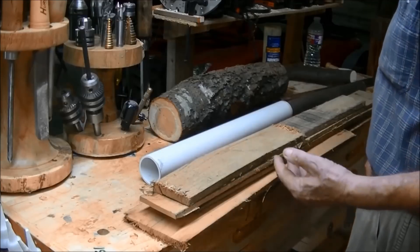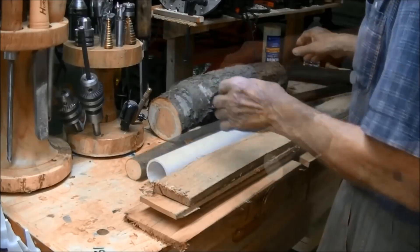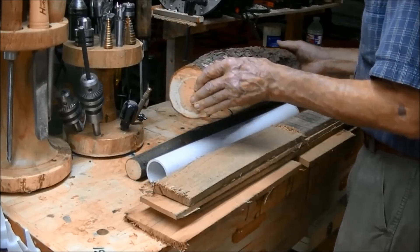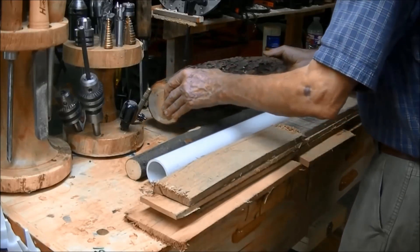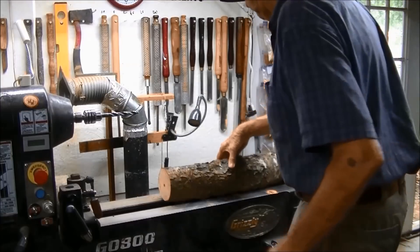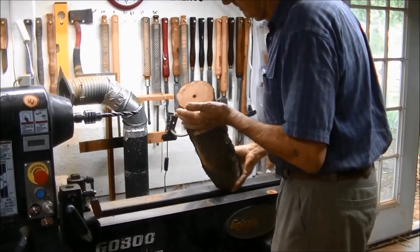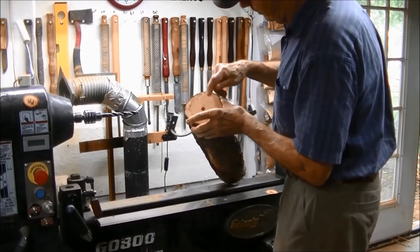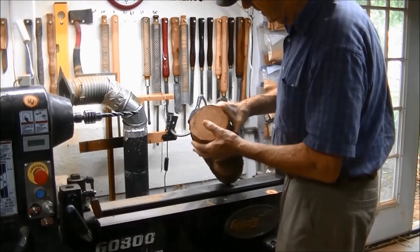The second handle is going to be a mixture of epoxy and wood. Here's a piece of honey locust cut down to 21 inches. I'll just turn the handle out of that. I did a couple of things off camera getting things ready. For this honey locust handle, I wanted to get a big enough piece to get below the sapwood — you can see right here — so it's all real hard heartwood.